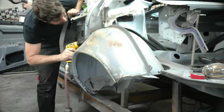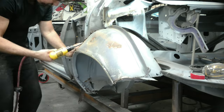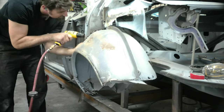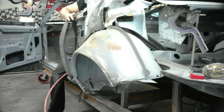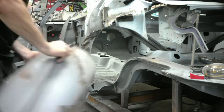At this point we're moving on to the wheel wells. We're removing the old wheel well right now. I left it in there to gauge where those last frame pieces go, but the air hammer just knocks out the spot welds. Same process just goes over and over again.